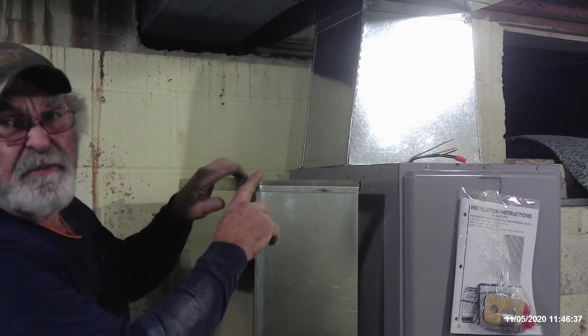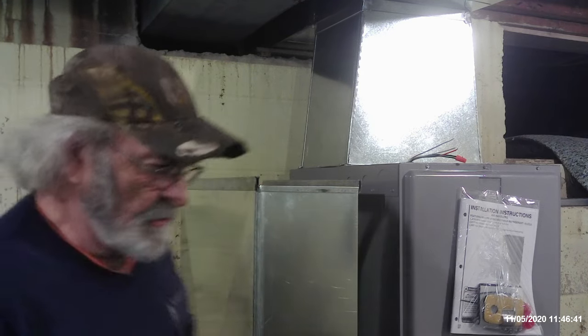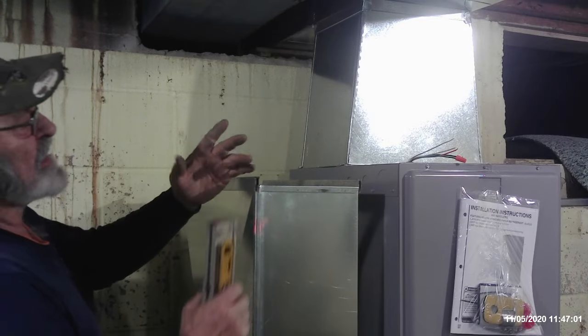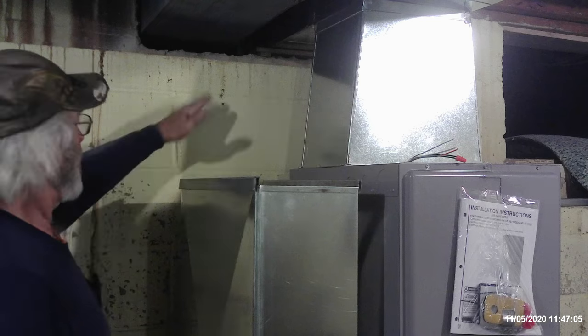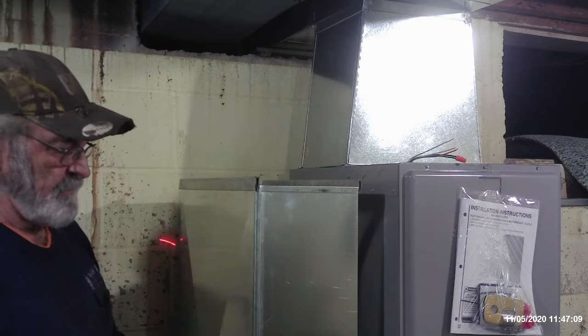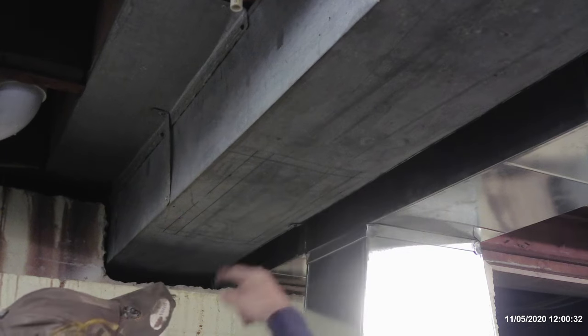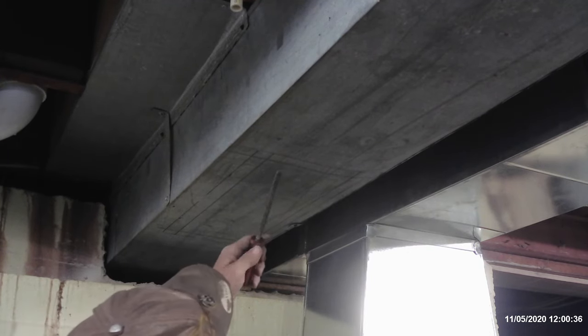Multiple ways of transferring these points. You can use a laser level. I use those quite a lot. You can use a laser level, or you can use a square, or if you've got something square, you can merely measure off of that wall in order to transfer those measurements up. I transferred those up to the trunk line, measured around, took 1 inch off all the way around for the S's and the drives. Now we're going to go ahead and cut that out.